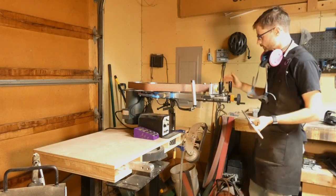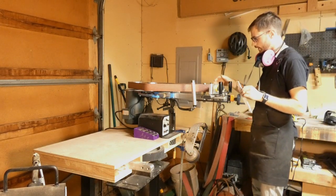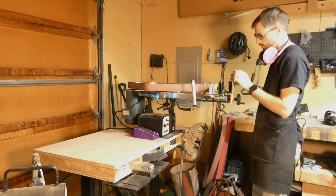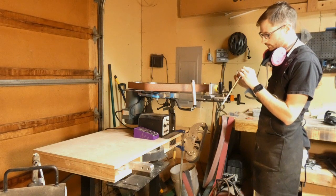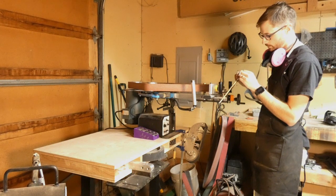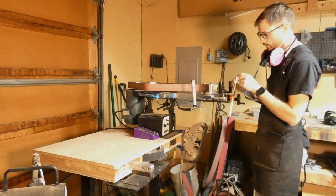Right now I'm not really using this, but what I recommend when you're doing something like this is push the tail stock out as far as you go, take very, very shallow cuts, and as soon as you're starting nicking off that material and you understand where your line is coming in, try to match up that angle with your cut angle that you want to do.